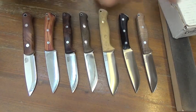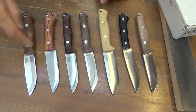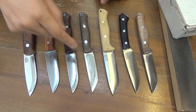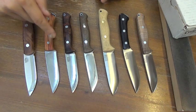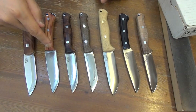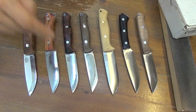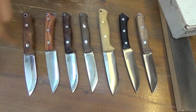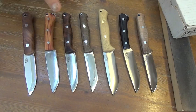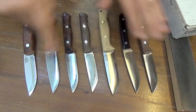A2 can do single DR, no problem, in 25 degrees — sharp. 3V can do 2 DR, no problem, in 30 degrees — not scary sharp, but sharp enough. Out of the box at 35 degrees — very tired, very dull. I can't bear its original out-of-the-box angle. Therefore, I reduced to 30, and now they all have the sweet angle of the 3V: 30 degrees. A2: 25 degrees. Which do you like?